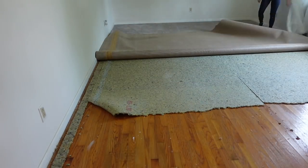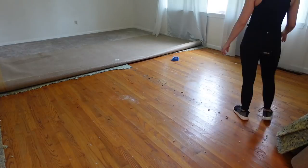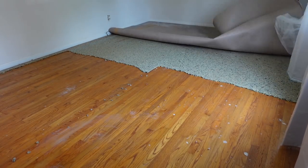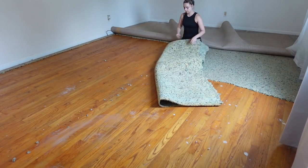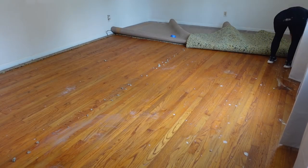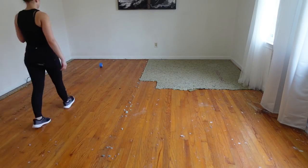Basically what I'm doing is pulling back the carpet and then pulling up the underlayment. I started to just rip it off — you could use your utility blade or what I did for the underlayment was just use my foot and rip it with my hands. For the carpet it was much easier if I cut along the back side of it rather than the front side — that's a tip that will save you so much time. I'm rolling it up into smaller rolls and using painters tape, but I'd highly recommend going with something stronger like duct tape. I felt this way was easier and saved some space in our portable dumpster.